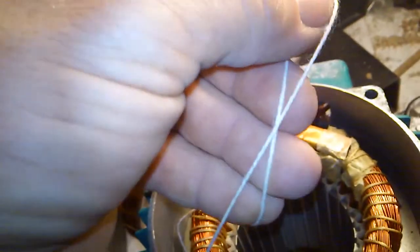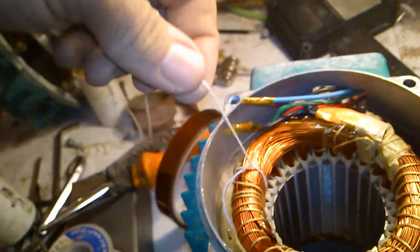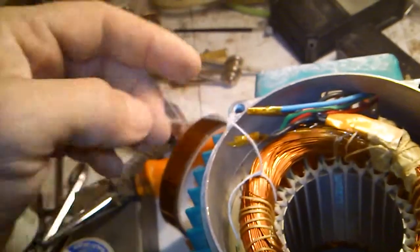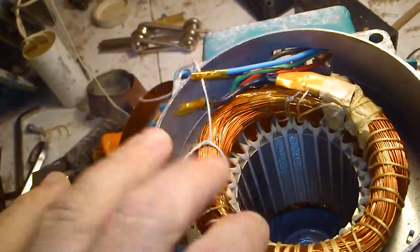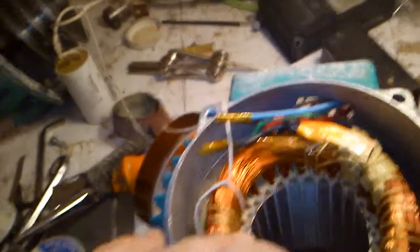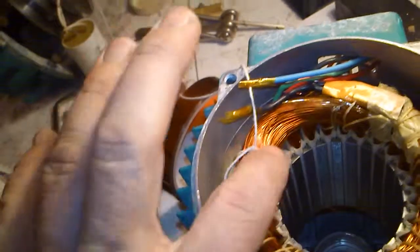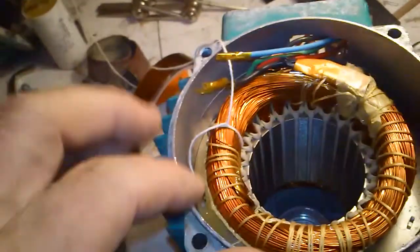I'm using a thread that I pulled out from an asbestos blanket — the kind you would use for putting out fire. The reason is because the last thing you want is for the engine to get to higher temperatures and have something start to glow red inside, further increasing the temperature and making a big mess.